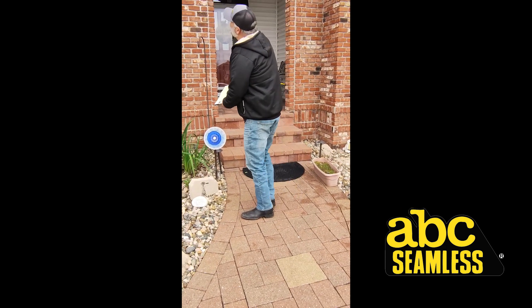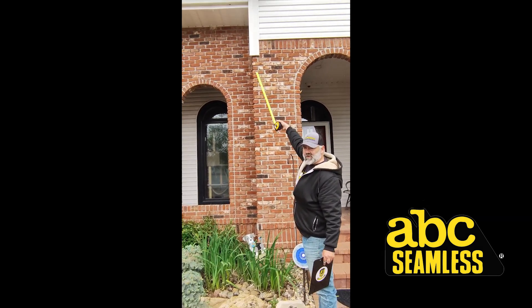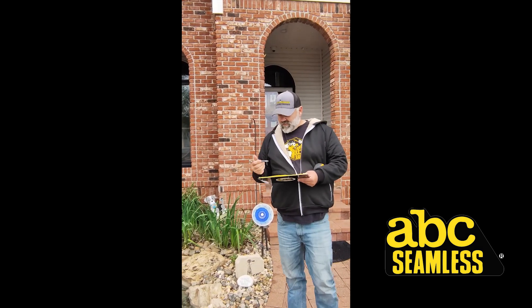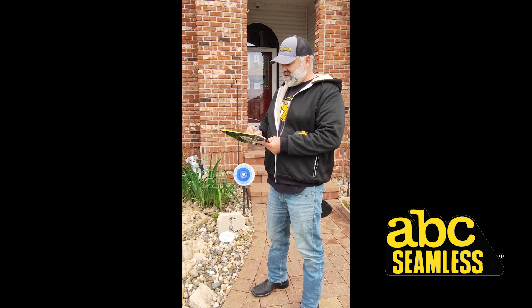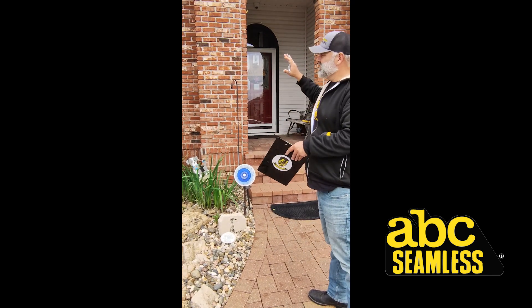As you saw, I measured all the way over to this point — at the end of the gutter — which will include this fold around. I have 27 feet dead even, so this gable would be 27 feet by 15 feet at the peak, and that includes all three of the major facets on the front of the house.